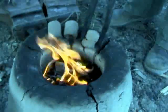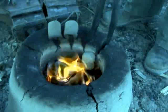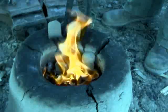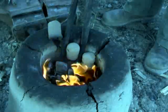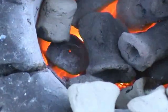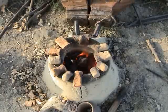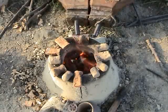This is an extremely important step. At 1150 degrees Celsius any remaining water is evaporated extremely quickly. If water is trapped beneath molten metal it may discharge explosively, taking along any hot liquid material in its way. This may cause serious burns to those body parts close to the casting funnel.